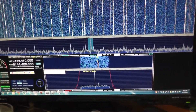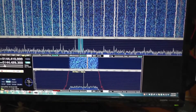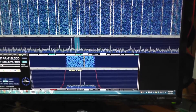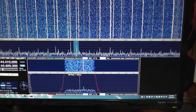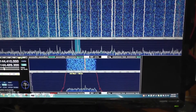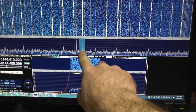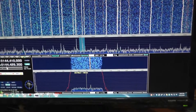G'day, Brenton here VK2MEV, and this is just a quick demonstration to show that my software-defined radio project is receiving on two meters. That tone you can see in here is the two meter dual beacon — it's about 130 kilometers away and it's about 17dB above the noise floor.